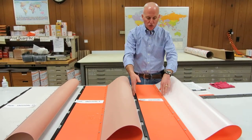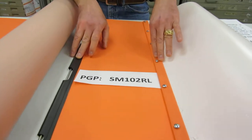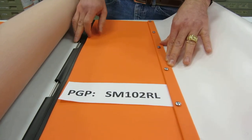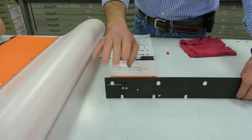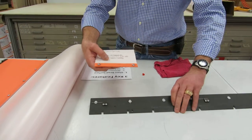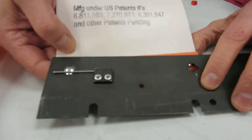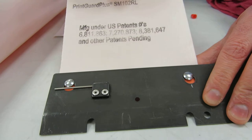Finally, let's go to the fixtures that secure the jacket to the printing press. On this side we have the rivets — there are ten rivets — and then there are six die-cut loops, securing it onto the Heidelberg transfer cylinder. On one side there's a spring bar, and I have one outside the press so you can see. Our ten rivets snap into these teardrop holes on the spring bar, and when we pull it up to the up position, it sits in the top of the teardrop.